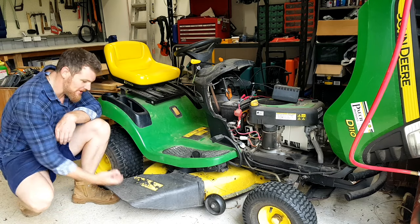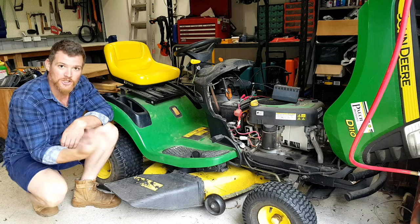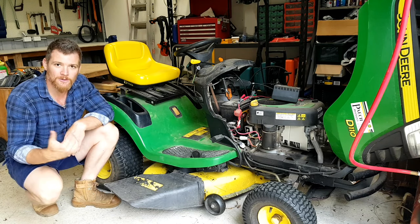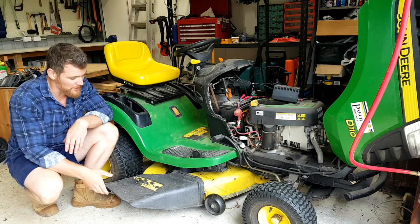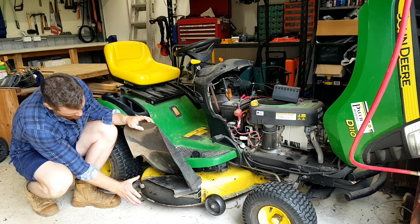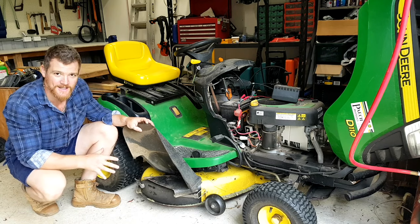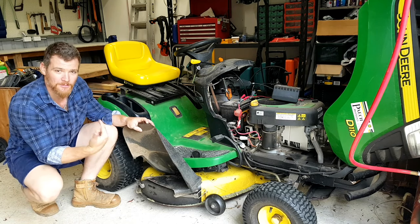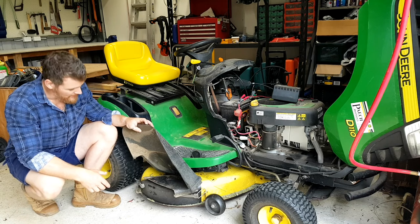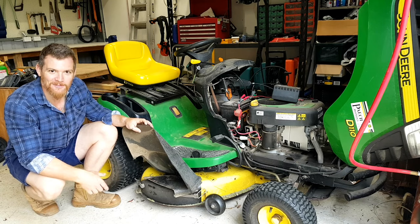Here's the side discharge. I've got this hooked up for mulching. Normally what would happen is you'd chop your lawn and it's spat out the side — you windrow it up and then maybe hit it with a bush mower or catcher. I've got this set up for mulching. Under here we've got a little plug for over the side discharge, which keeps the cuttings inside your deck — they get churned up a bit more and then eventually released onto the ground for mulching. It's also got mulching blades under the deck.